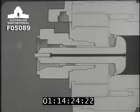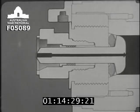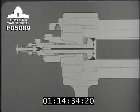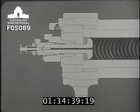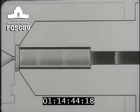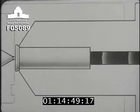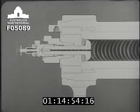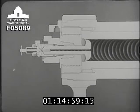Why didn't it blow the tube out backwards and so escape to the rear? Because the tube is held in position by means of this firing mechanism. When the gun is fired, gas passes down the vent from the chamber and forces the case of the tube to expand very tightly against the walls of the tube chamber, making it impossible for gas to escape between the walls of the chamber and the sides of the tube. So you see that the obturating pad and firing tube together prevent any rearward escape of gases.